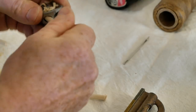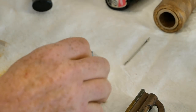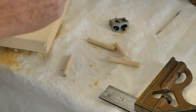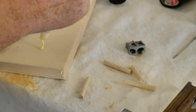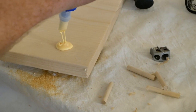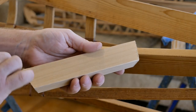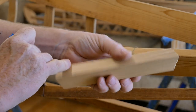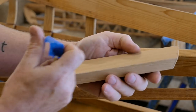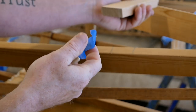I'm going to pour some wood glue — just a little bit. I went ahead and broke all four edges with that radius plane; you could use sandpaper for this as well. I just find it's a little bit easier to break the edges before you put it in the actual kayak.